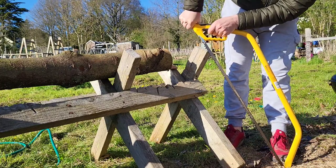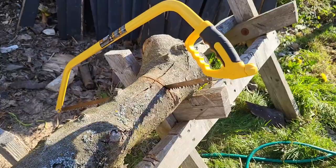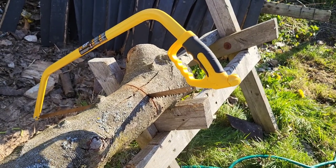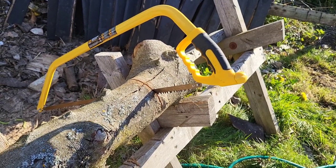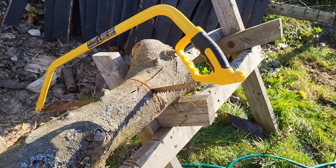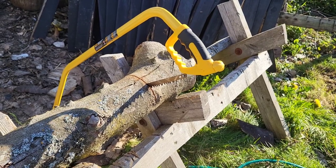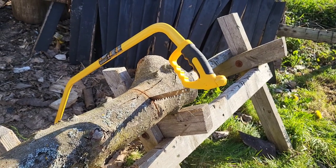I can turn it a little bit but it's just not ideal — having some sort of grip on that would make all the difference. So even after tightening up the blade, I'm still finding that the cuts aren't very straight. I've done a lot of cutting before with a smaller saw, and I remember my larger orange saw was very similar, so it could just be that this is the larger saw, but I'm still finding the same kind of problems. The cut won't be straight, it squeezes and nips the blade, you have to rotate the wood, which makes it a lot of effort.